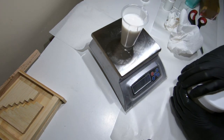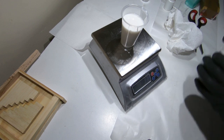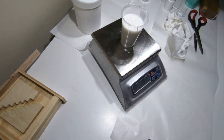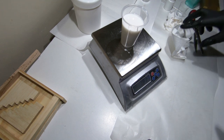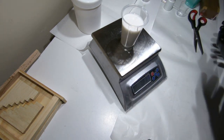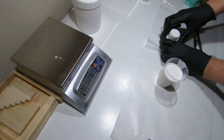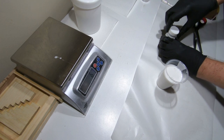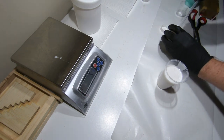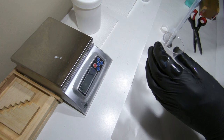We want 180 grams from this. I think last time it was about 190, but when you add the catalyst it adds to the extra bit, so hopefully we've got it right. These paper towels really do come in handy — make sure you rip them off first so you don't have your sticky hands touching everything. This is the catalyst that comes with it — it's 3%, so we've added 180 grams: we're going to add 3ml for the first hundred, then 1.5ml for the rest.